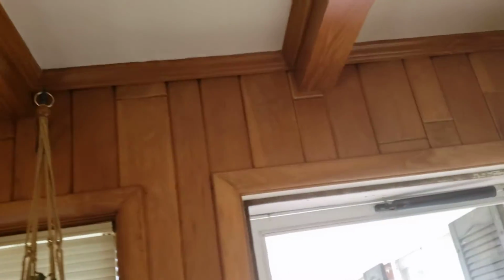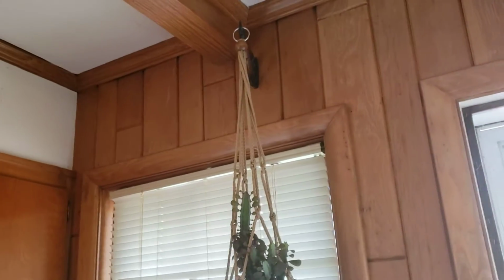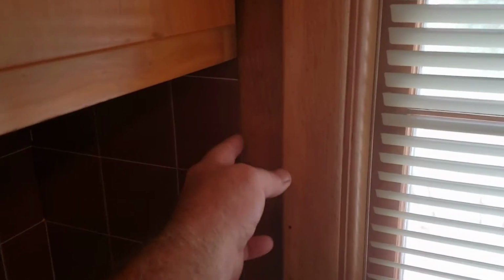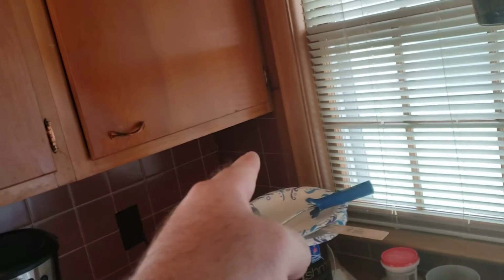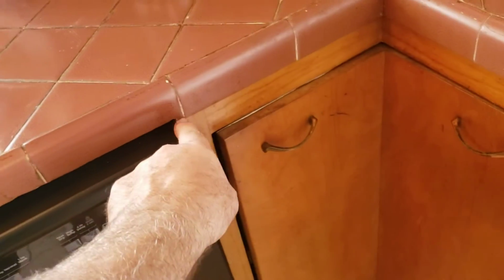Notice that this is actually sheetrock here on the wall behind with tile on it, but the rest of the room is a tongue and groove panel that's actually applied to the walls. That's not flooring, that's tongue and groove paneling from back then. And the cut-in to that, if you look right here, this is flush with that thickness, so they've built this out to that same 3/4. Measurements I'm giving you are the best I can tell, plus 1/4 inch on tile where there is tile, plus 3/4 of an inch like here, where there actually is additional wall space that's been built to the thickness. Just to get the dishwasher in this one, see here, they had to actually trim the bottom of the tile just to get the dishwasher underneath from that side of it.